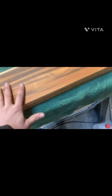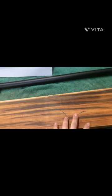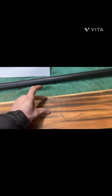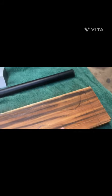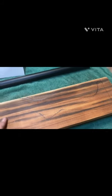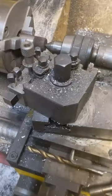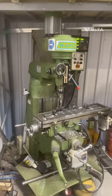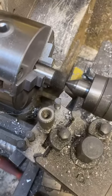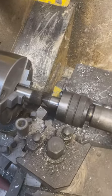I've roughly put an outline of how I want the stock - I want to increase the pistol grip angle for more of a sweep. I'm not sure yet what I'll do with the comb and cheek piece, but I'll adjust and file and machine it on the fly. The inlet I need to machine is 35mm but I've only got a 32mm end mill, and I don't have a collet big enough for the mill - so Eek has turned down this hardened end mill shaft. Wish me luck.